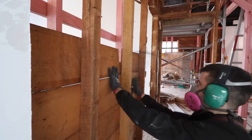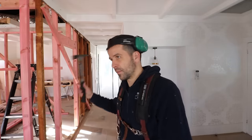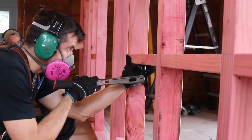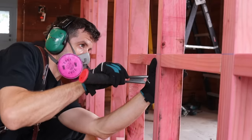But the main drawback for me is, again, the weight of the head. Anytime you're doing any type of hammering that isn't straight down, or any type of hammering that isn't side on, where the weight is swinging below you, it's working against your wrist. Or if I'm trying to maneuver something in, or just gently tap something, something's slightly in an awkward position, which happens a lot, that weight really pulls against you. The balance of this hammer isn't as good as the balance of the Vaughan that I'm used to.